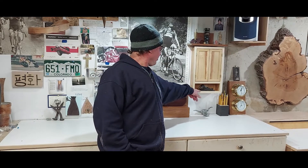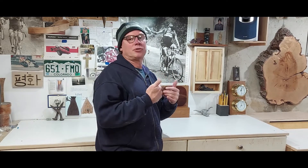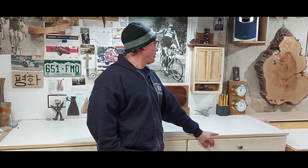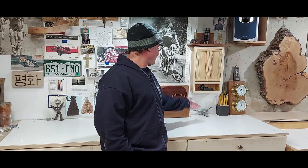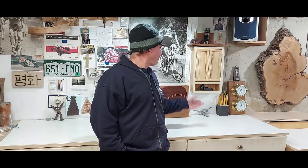You'll notice too that it has a face frame on it, and that's because when I went to mount the hinges I realized that the screws were half an inch long and the box sides were only 5/16, so that wasn't gonna work. So I decided to make this little face frame — it was kind of in keeping with the project, and we just had a scrap rip piece over there. We actually hold on to rips like that, and it's for reasons like this that it's helpful to have them. We end up using them, so I put that on there and the screws didn't come running out.